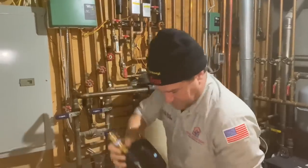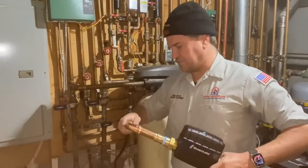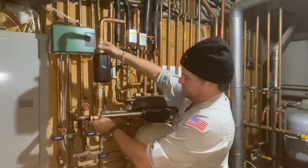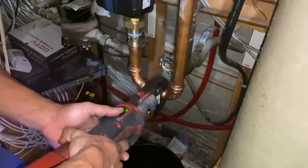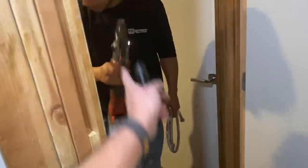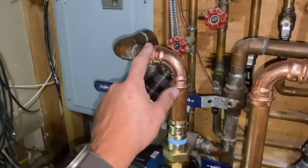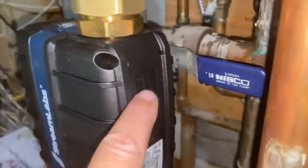We're going to put the valve here — take a little rough measurement. We have another nipple going there, another elbow, and another elbow here. Off camera Frankie's going to help me — we'll hold that, take a measurement from here to there to connect it. So we have all our connections pressed in. We're using the Milwaukee M18 Force Logic with the 1-inch jaw for a copper press. We cleaned and deburred both inlet and outlet and pressed in our connections — ten connections total — and there's our direction of flow. We were going to go up but it looks more in line with everything else pointing down.